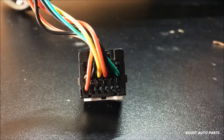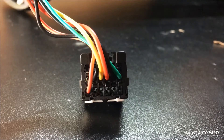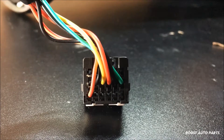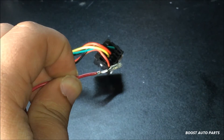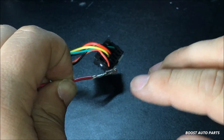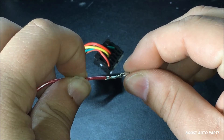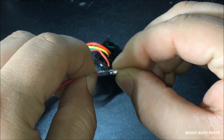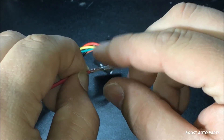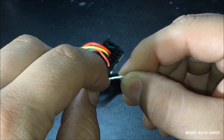The white wire with the red stripe is going to go into the third location from the left, and the solid red wire is going to go into the fourth location from the left. The orientation of the pins going into the connector does matter. As you can see, there's a bit of a dip — we will refer to this as being right side up. All of the pins are going to go in with the arch down, and you can see the wire is crimped on this side, so you want it silver all the way across.